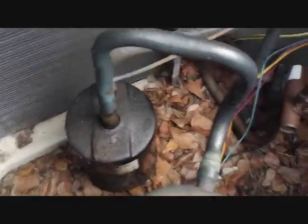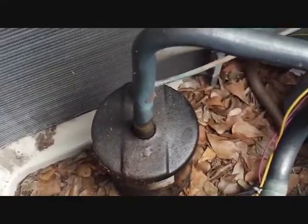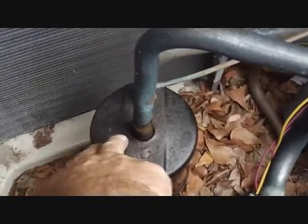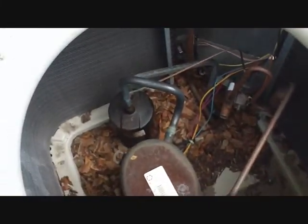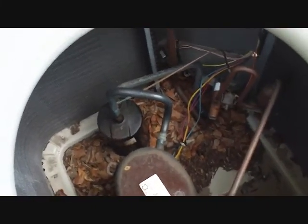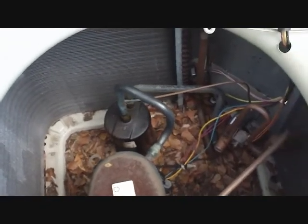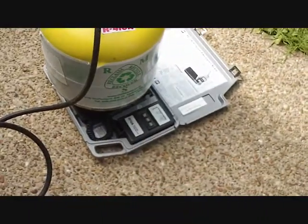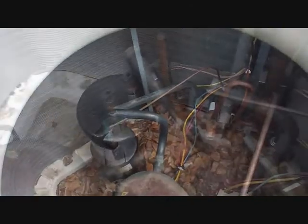Here's the inside of our unit. Here's our accumulator, and you can see the oil stains and dirt smut coming from right around the base where it was leaking. So we'll pop this one out, put the new one in. There's a lot of room in here, which is nice. A lot of times it's all cramped up inside these things, but this looks pretty good since it's a three ton. It would be a different story with a ton and a half. I'm going to go ahead and finish this reclaim, which we're about 13 ounces away from done. I'll catch up with you in a minute.